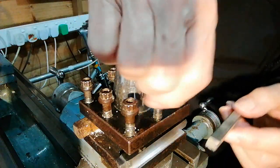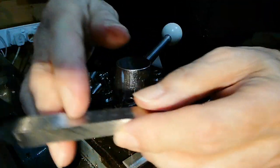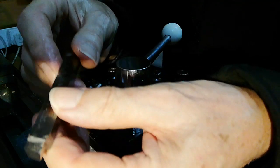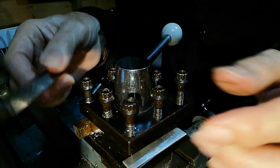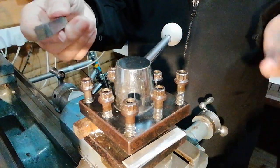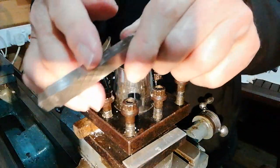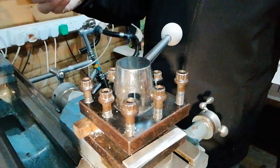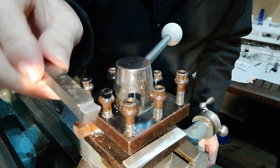Just to mention for people just starting off in turning — this is high-speed steel tool material. It's a much better material than carbon steels. There are a lot of cheap tools made of carbon steel; they don't last as long. High-speed steel is more versatile than the carbide tips you see, because the problem with carbide tips is they're very difficult to sharpen — they're designed to be thrown away. With this kind of tooling you can regrind and resharpen the tool and use it again.